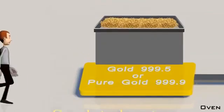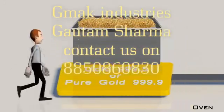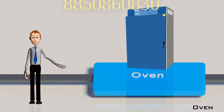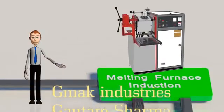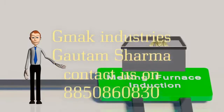The pure gold sand of 999.5 quality generated from the aqua regia process is first dried in an oven — or it can be pure gold of 999.9 from the electrolytic process. This gold is then melted in an induction furnace, after which the process follows depending on the configuration of the gold bar desired.